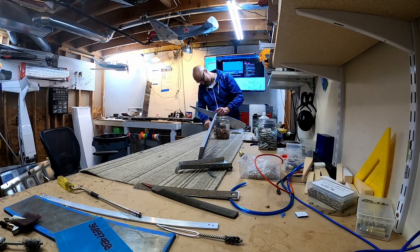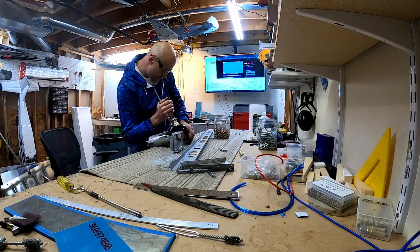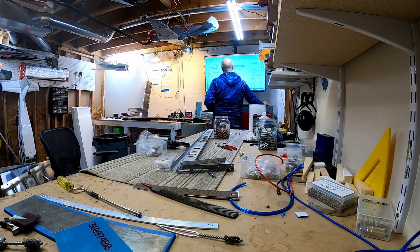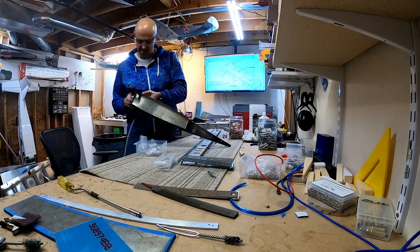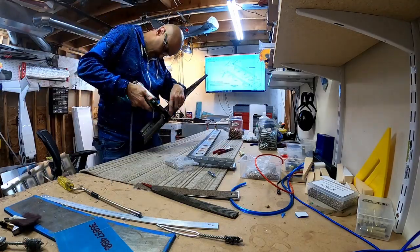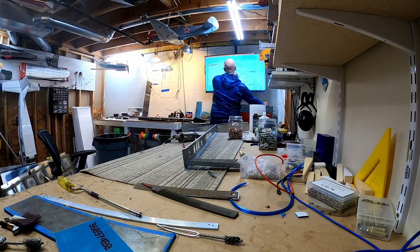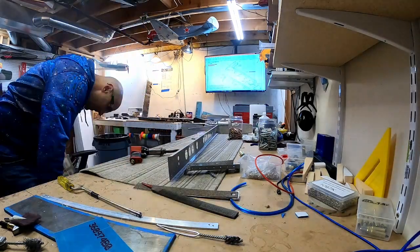This is funny because you've got to go over two flanges to get the squeezer in there, and you can see how kind of tight it fits. I had to shoehorn it in over the corner where the flanges diverge from each other, and then adjust the adjustable ram once it was in there. I would still rather do that than using the rivet gun and bucking bar on these because they're such a lightweight — it's a large piece, but still a pretty lightweight piece that would be kind of hard to control the gun on.